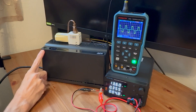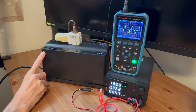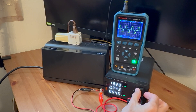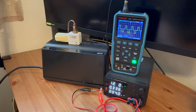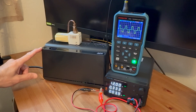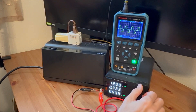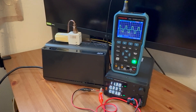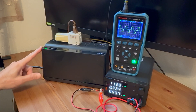I've run this test already once, and you'll note that this will start beeping that your battery is pretty low at a certain voltage — a lot lower than 13.6. So we're going to jump down rapidly until we get near the range where I remember it starting to beep. At 12 volts, I also notice this flashes twice when there's pretty much good capacity in your battery. At 13.6 volts it was also flashing twice with a pause. You can see that 11.3 volts is where this starts to beep, indicating the battery is getting low, and the light also starts to flash differently — a rapid flash with no break.